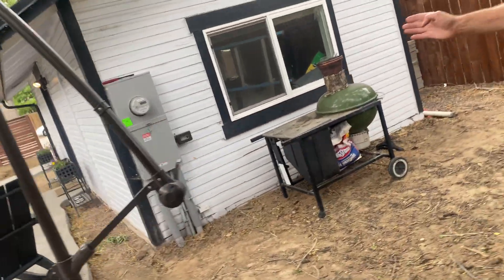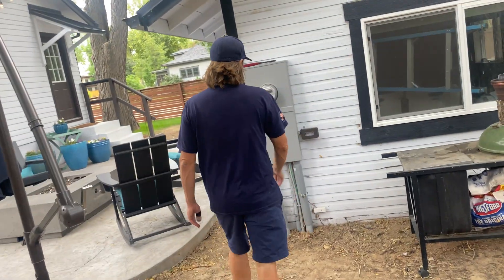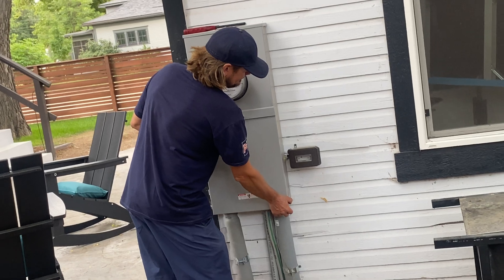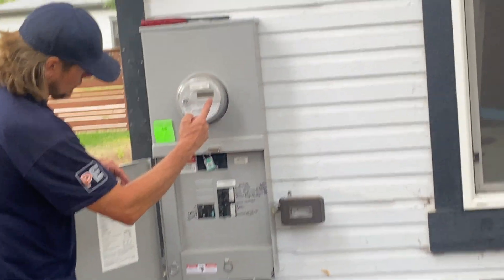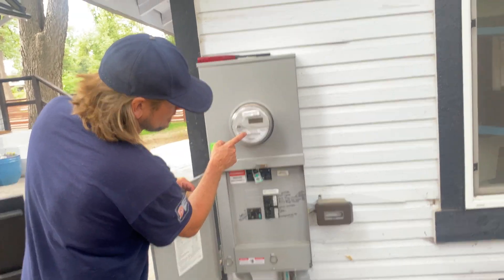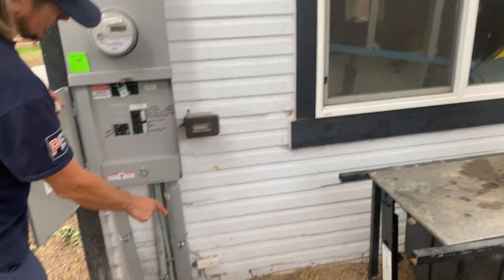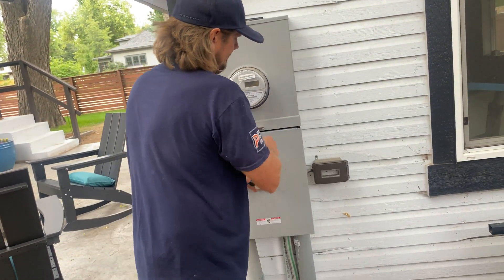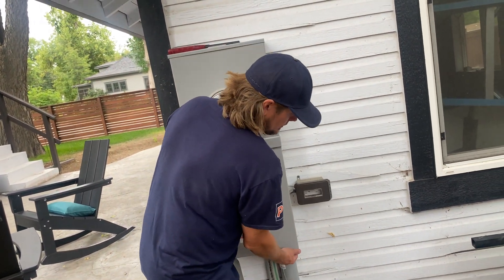This had to be set with the new codes with emergency service disconnect. We put a plug here, rewired the garage, added a surge protective device, service disconnect sticker, main breaker bypass lever, meter, inter-system bonding bridge bar, two 8-foot ground rods, and then extra breakers. We gave them 150-amp service because that was the max they allowed us to go to.